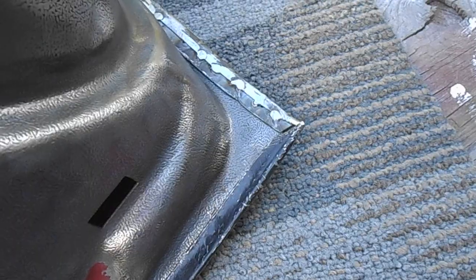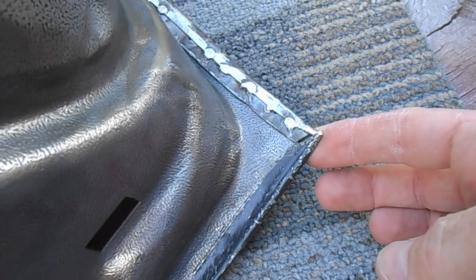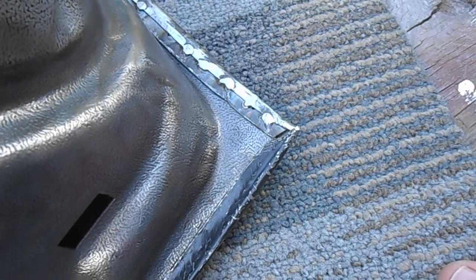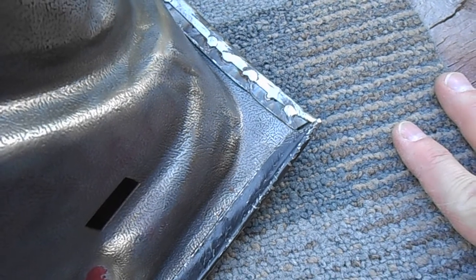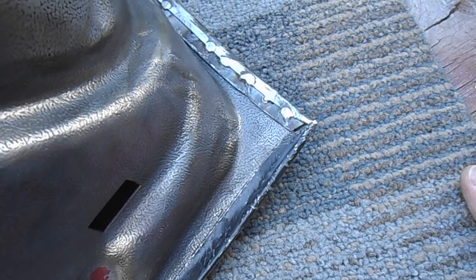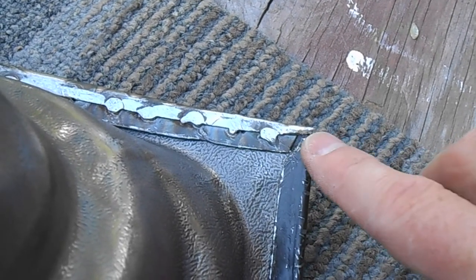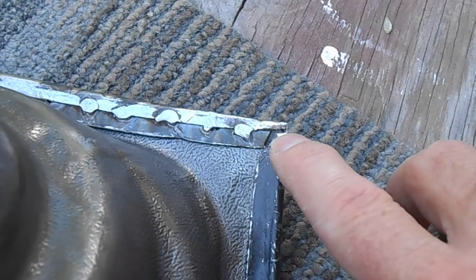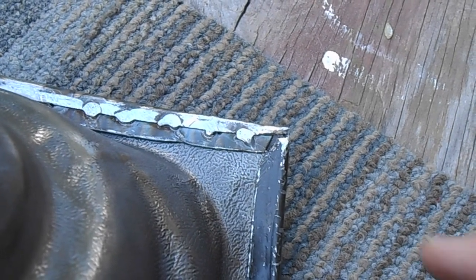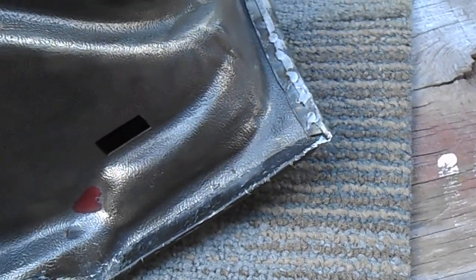I kind of have the same situation there. Here's the back corner at the bottom. Compared to the front corner this one really doesn't look that bad and I haven't even started to do anything on it yet. So I will do the same thing that I did on the front corner - I'll just cut a little bit of a groove in here to give a place for the flange on both sides to fold into, and then a few light taps with the hammer to bring them down to where they belong. I took the grinder and cut a little notch right here above my fingernail and just tapped it a couple of times with the hammer. I really didn't work it too much in this area - mostly I just made the cut and I'm pretty happy with how that came out. I'm not going to overwork this edge.